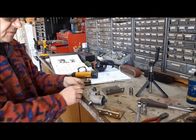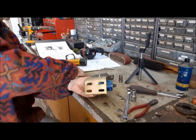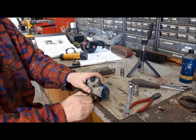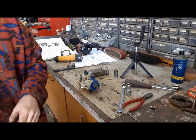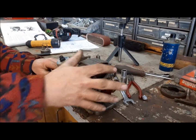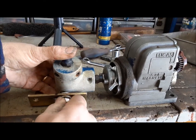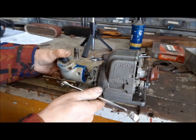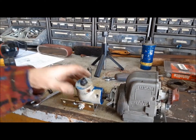I've taken that carriage bolt out and replaced it with a slightly longer one, and made the hole oversize so I've got a little wiggle room. We can check on the bench here to compare the height to the center of the magneto and get this pretty close. I'd say we're a tiny bit high, but right about there should be okay. Let's go put it on the tractor and see what it looks like.